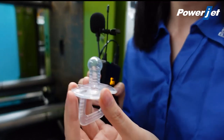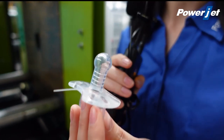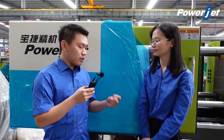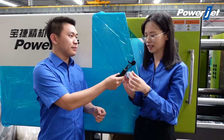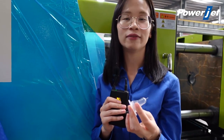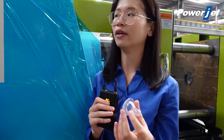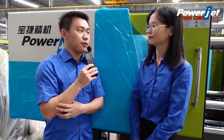The production is very convenient and can be set to full automatic. What is the cycle time of this product? Since we are making 16 cavities on this mold, the cycle time is around 45 seconds, so we will produce around 1200 nipples per hour. The output is big enough.